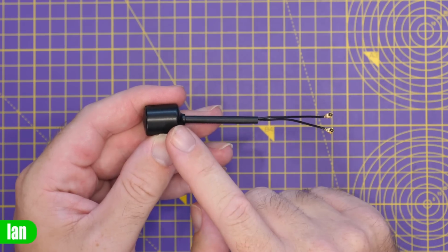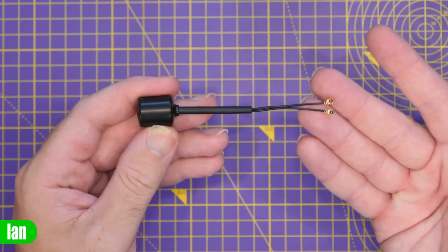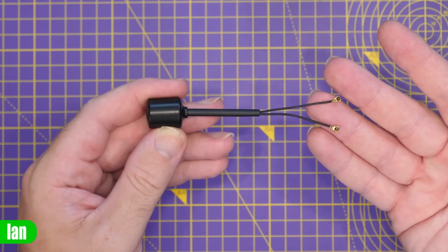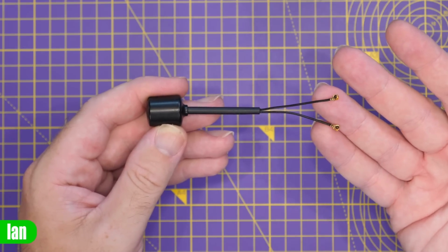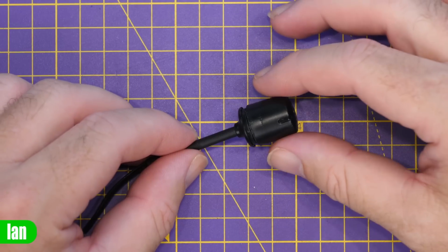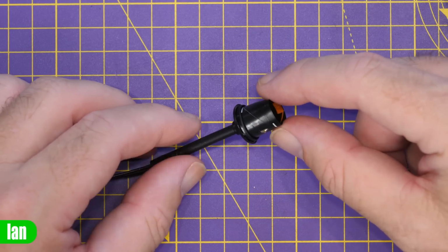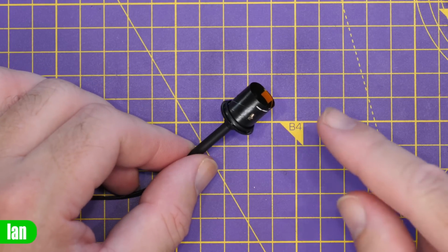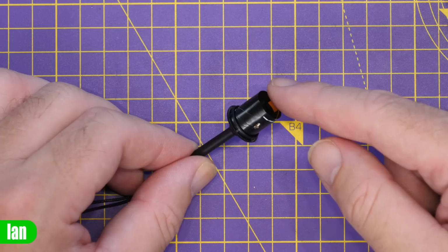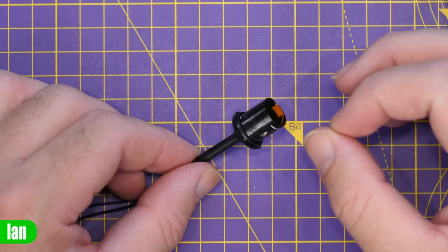Now, what we're going to do in a moment is actually tear this antenna down and give you a closer look at how it actually works. But the very basics are, it is dual linear elements, opposite polarized to cancel each other out. And as I've said, both inputs are both 2.4 and 5 gigs capable. Now, taking a look inside, you'll see that the antenna itself is actually made from this flexible material. The way it works is this: there are dual band linear elements printed onto this material. They are set at 45 degrees opposite each other to give a linear polarization.